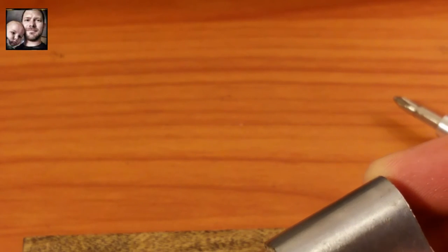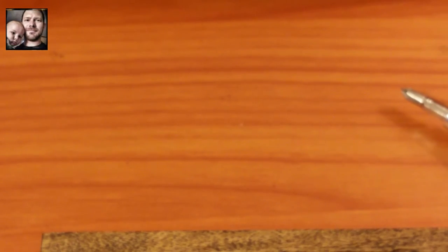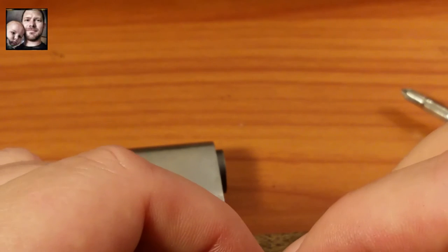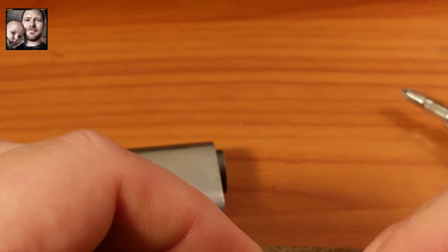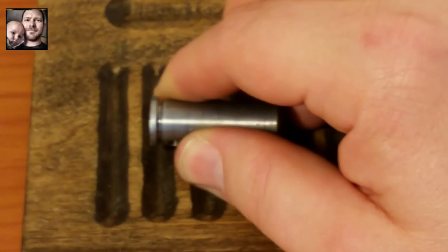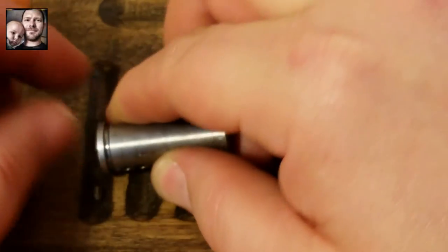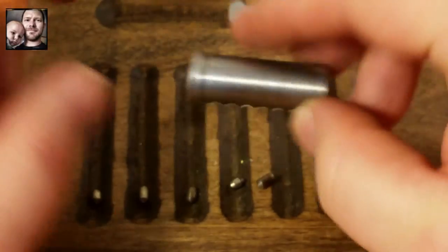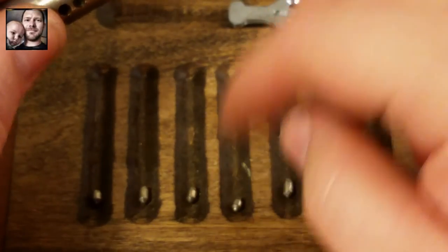Let's see if my normal follower will fit. Oh, that's tight — too tight. Let me see if a Sparrows follower will fit it any better. Yeah, that fits. We do see all five pins — it is actually available to be pinned up for six. Let's go ahead and dump these out and take a look. I'll zoom in on the pins once I get them all out. They are all tapered, and they're tapered a little bit more wildly than I figured they would be.